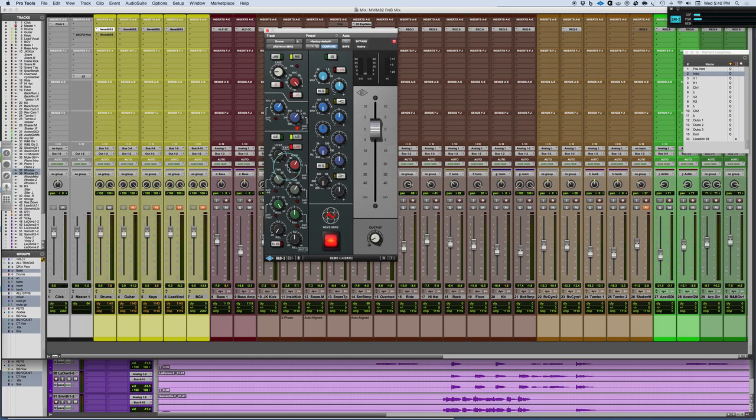There's a makeup gain control here. If you pull up on it, then you have a hard knee, and that makes the compressor more aggressive. The threshold control, there are many push-pull switches on this. When you pull up here, it changes the threshold down by 20 dB lower than the reading that you see here. So if this is not going low enough, you could do it from there. The ratio goes 1:1 at its lowest setting all the way up to a limiter setting.